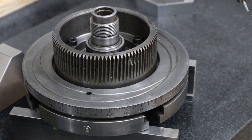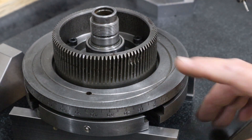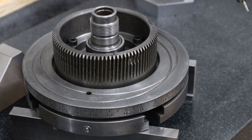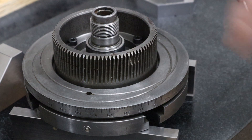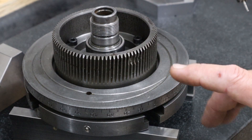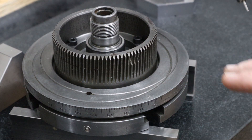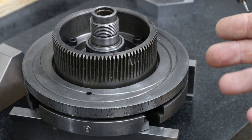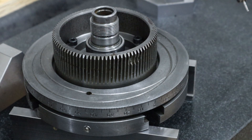After taking the index table apart, I decided not to fix the damage done from the worm on the worm gear - it seems to be okay. I've got this set up right now to do just a quick test to see what type of parallelism I have between the face and the surface that rides inside of the head itself. I will probably end up scraping this in the future, but not right now.